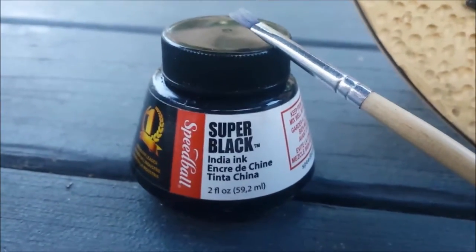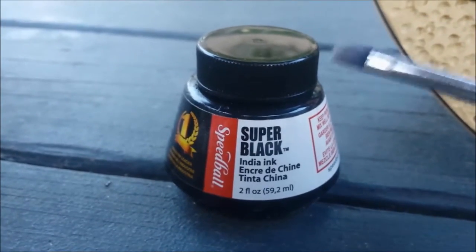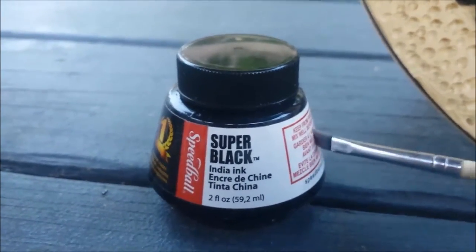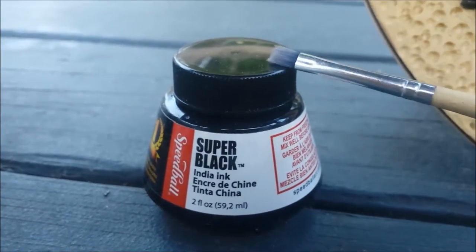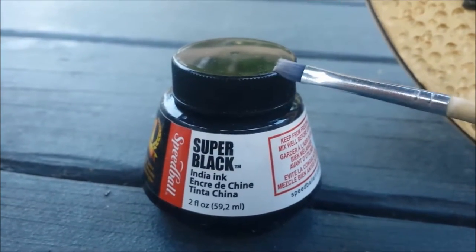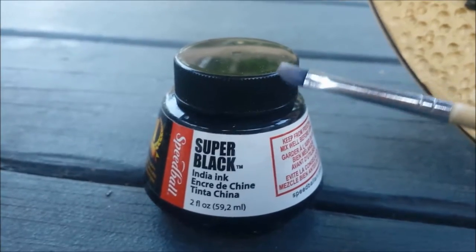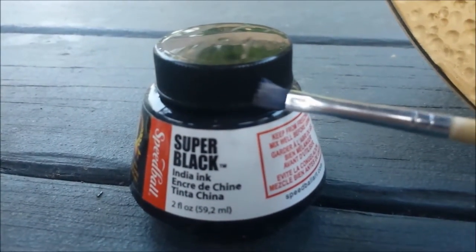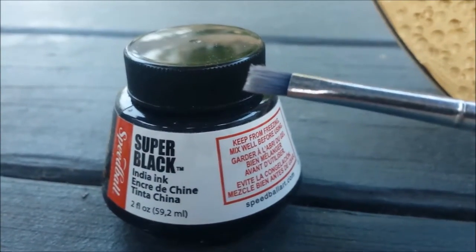By the way, I was told in forums that I may as well throw my brushes away if I'm going to use this stuff. They said it can't be cleaned. Somewhere else on the internet, I found a woodworker who says, yeah, I use a 50-50 mixture of denatured alcohol and lacquer thinner, and the brushes are just fine. And I've used this brush for three coats on this thing. This is the only brush I used. And it had gray bristles, and it still has gray bristles with a little black in them, but no runover. You can clean your brushes. I use a 50-50 mixture of lacquer thinner and denatured alcohol. Soak the brush good, blot it in some paper towels, and it beats throwing a brush away, right? Yeah. Anyway, I just figured I'd throw that in.